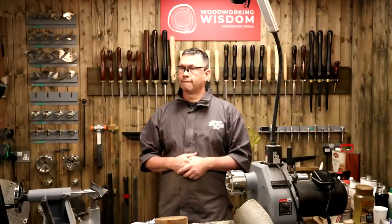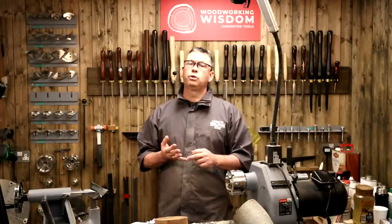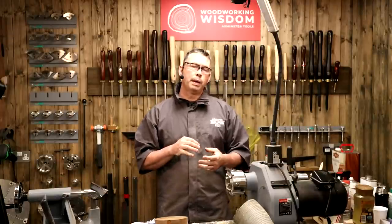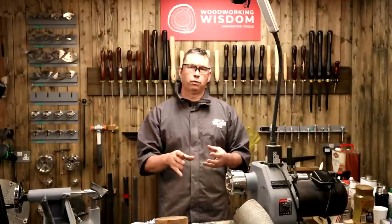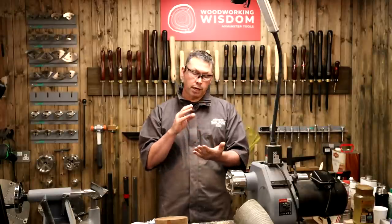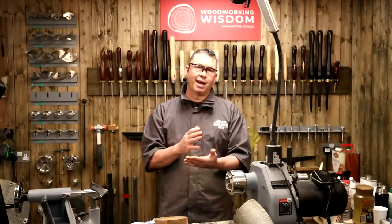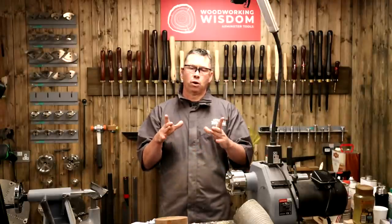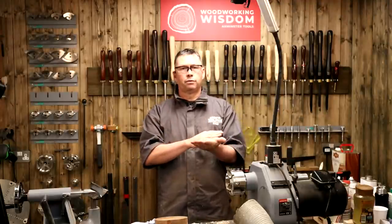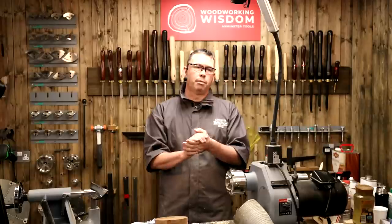Question here. If I'm laminating wood into bowl blanks, what adhesive do you recommend? Personally, I've always used a PVA. I've used the Titebond 2 PVA, but a lot of people use polyurethane as well. Both of those glues, if done properly, will be sound, but you do have to take precautions. You have to make sure all the surfaces are clean and dry, the usual things. Read the back of your adhesive, clean and dry, clamped well for long enough. So you won't be able to glue up your bowl blank in one hit. You're going to have to do a couple of joints, leave them, plane them back, then the next bit and so on before you move on.